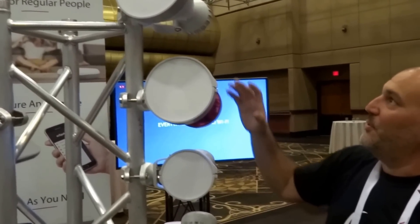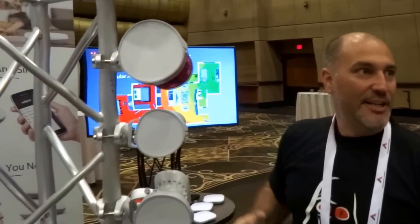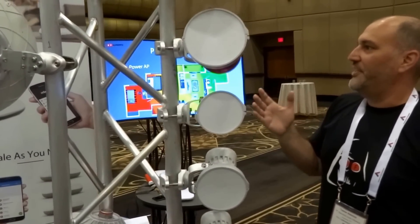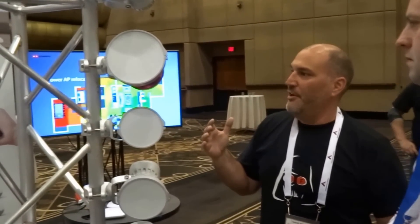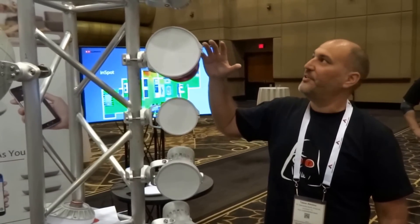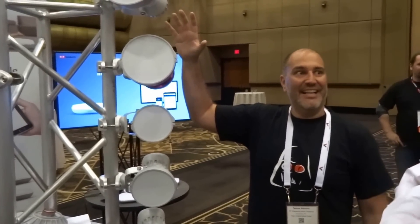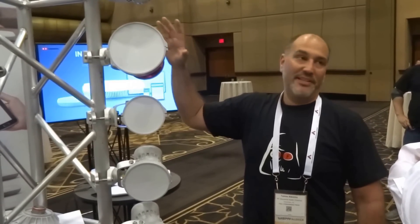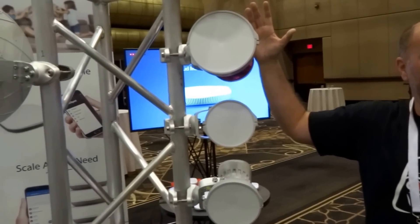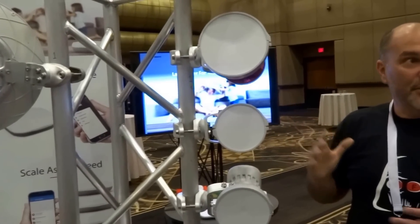These are our symmetrical horn antennas. We have everything ranging from 30 degrees down to 90 degrees, with a gain rating of about 10 dB up to about 18 dB. Symmetrical horn antennas have a uniform symmetrical beam — so it's 30 degrees wide and also 30 degrees tall, and the same for the 90, so it's 90 by 90. Horn antennas by design naturally suppress side lobes — there are practically zero side lobes.